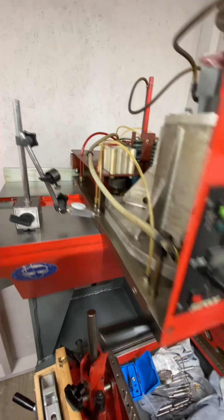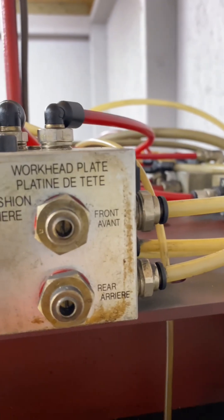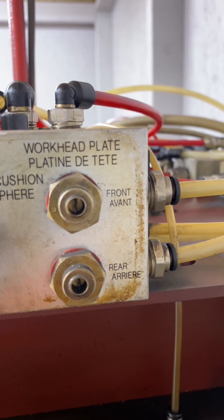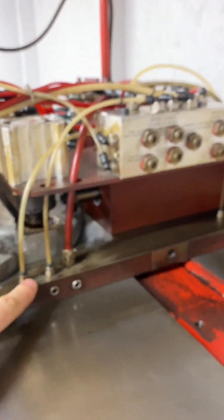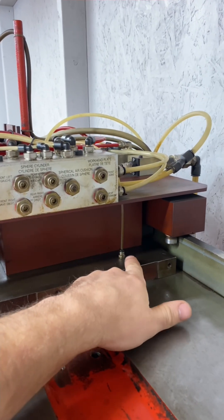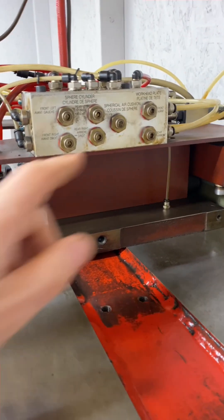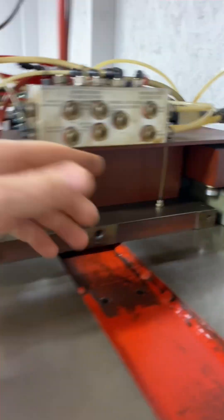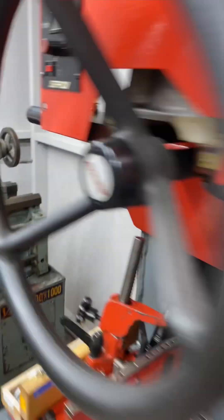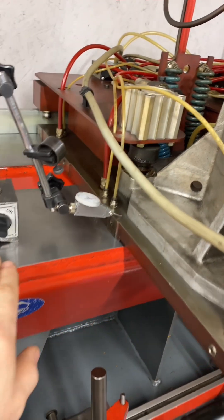There are a couple of adjusters around this side. Looking at the labels — front head vent and rear vent — so the rear one is the bottom one and the top one is the front one. I've just been playing around with them. You need a lot more front obviously because it's heavier than the rear to get the same lift. I think I've now got it at basically 0.03 of a millimeter across the top, where this is slightly bowed.